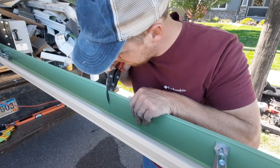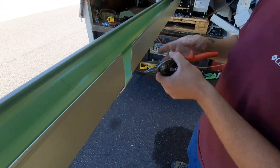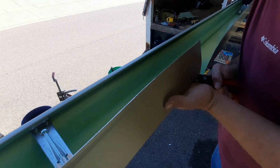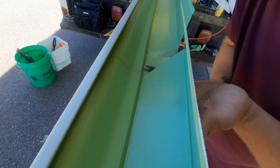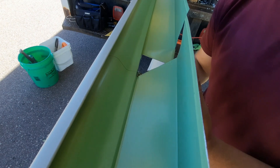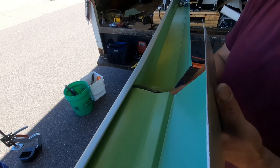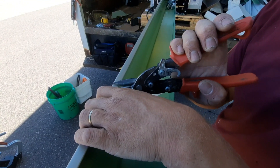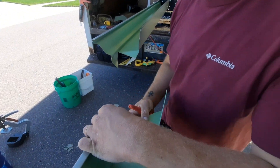Come on this side of it when you're cutting the slick. Cut this back first, cut a big tab out of it so you've got room to put your snips in. Get inside the piece, cut straight down, then cut another relief cut, take your snips and bend that down. You're just following up this line — one line on the slick and you follow it exact. Get to the top of your line and then just cut straight up. For these insides I always cut the tabs straight — you could put an angle but there's no real use, it just gets in the way.